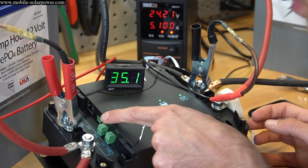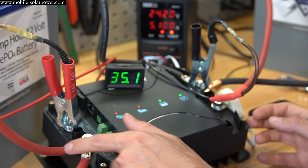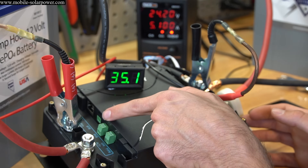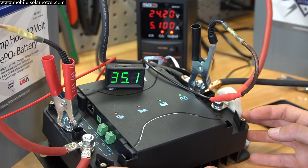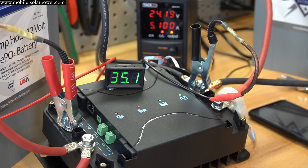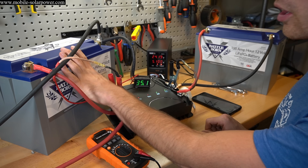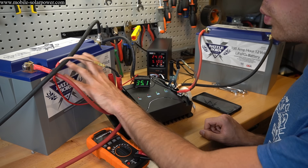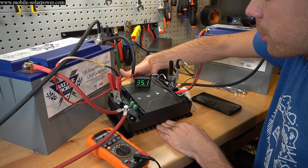It's preferable to have the battery voltage sensing wires connected to the BVS port. My wires are thick and it's a short run so it's okay for this test, but when you install it yourself, read the manual and add those BVS wires so the unit has an accurate battery voltage reading and can charge properly. But yeah — it works. It's so easy: you just connect it and it works. The heat sink on the back is getting quite warm under this load.